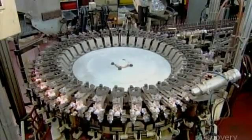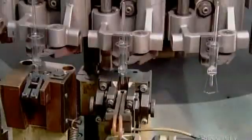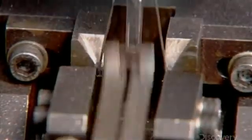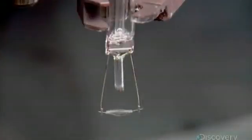Grippers transfer the closed mounts to a carousel. It revolves to allow the mounts to receive a coil made of tungsten metal. This coil is the filament of the reflector light bulb. Mechanized fingers attach the small coil to hooks on the 2 lead wires. The coiled filament is wobbly, so next it gets some support.